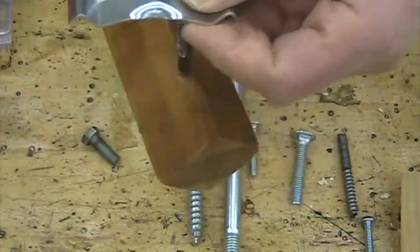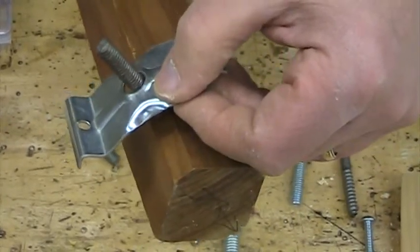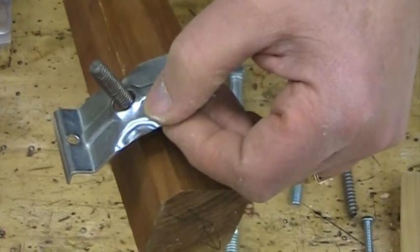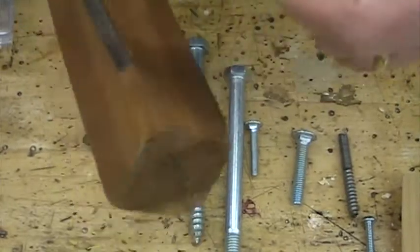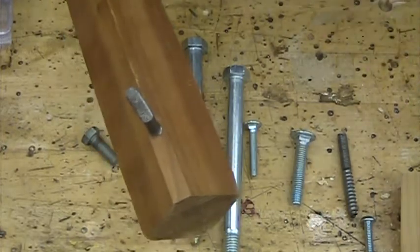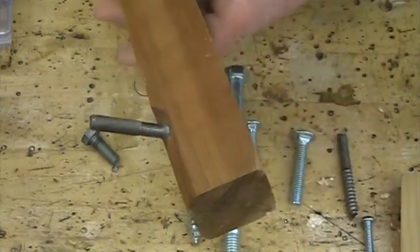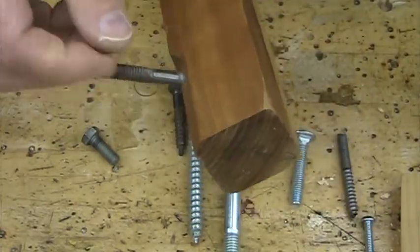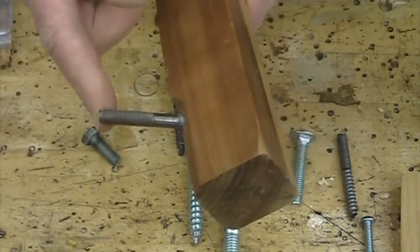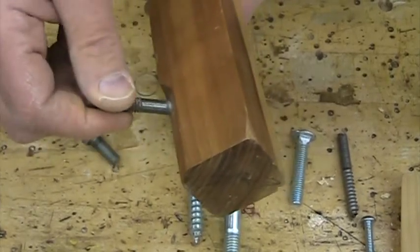The hanger bolt usually fits through a plate in the bottom of the table that hooks onto the other components, and you put a nut on there that holds the leg in place. When you want to take the legs off to move, you take the nut off, the leg comes out of the table, you put it in the truck nice and flat — doesn't take up much space. When you get to where you're going, flip it upside down, throw the legs back on, put the nut back on and you're back in business. The nice thing is you could do this hundreds or thousands of times and not wear anything out, because this is a metal shaft with a machine thread that has a nut on it. So that's typically where you see a hanger bolt.